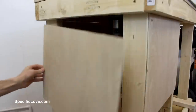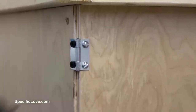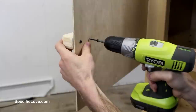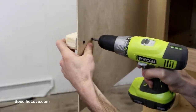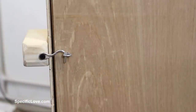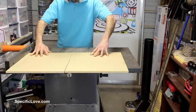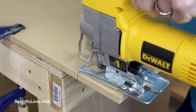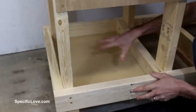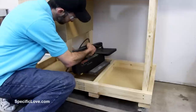Next up was adding a door so I could access the router. So I added some simple hinges to one side of the plywood. For the other side I wanted a hook latch. I did not have any on hand, so I modified another type of hook to pivot on a small piece of 2x4 that I gently attached to the plywood, and it turned out better than I planned. For the bottom shelving, I cut down some ½ inch MDF into 3 separate pieces and then used a jigsaw to cut out the corners. I chose to have them sit lower than the bottom frame so I could utilize that extra space, and it worked out great for adding several of my tools for storage.